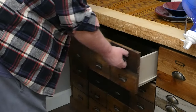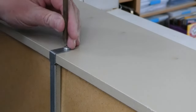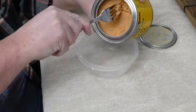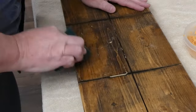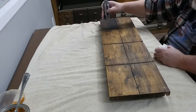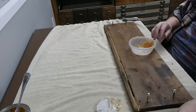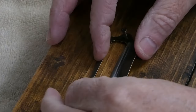After a few months I decided to give the sideboard an application of finishing wax. This meant that the drawers had to be removed one at a time, disassembled, and all of the hardware removed. The paste wax was applied with a scrubbing pad to help the wax bind into the wood and to ensure complete coverage — you can see the additional luster it gives. Make sure that any extra paste doesn't get stuck in the grooves of the door fronts, and don't forget to wax the edges and backs of each board.